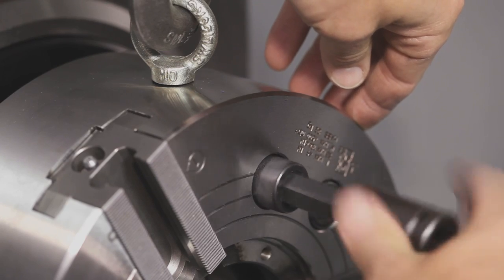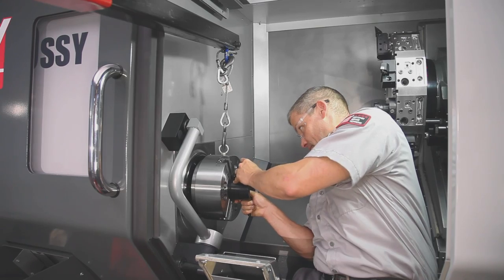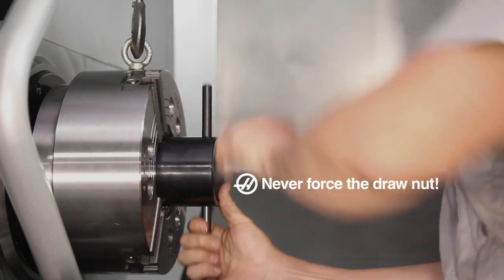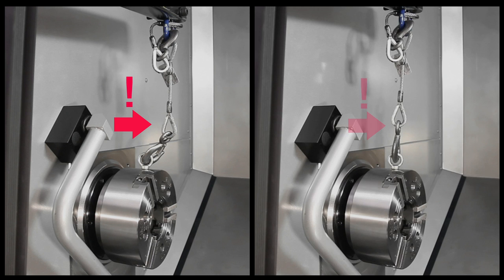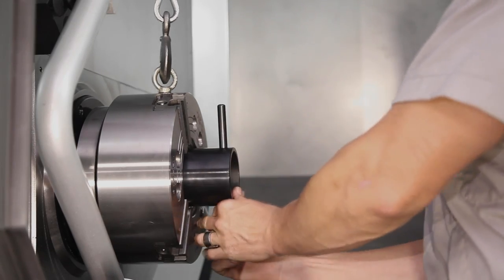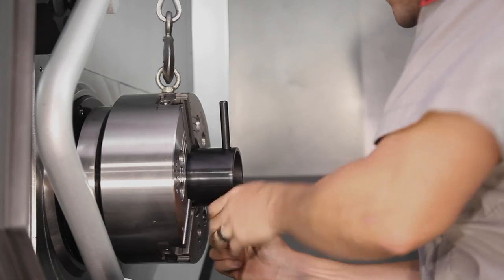Remove the six chuck mounting screws and set aside. With suitable tension lifting the chuck body, Andrew unscrews the draw nut counterclockwise from the threaded end of the draw tube. The nut should loosen by hand. If the nut is especially tight, do not force it. If the nut is not unscrewing easily, it means the hoist is exerting too little or too much tension. Adjust the hoist until the nut rotates by hand — when it rotates easily, the chuck is suspended at the correct height. Attempting to unscrew the nut while it is bound will damage the draw tube and draw nut, which are expensive and labor-intensive items to replace.